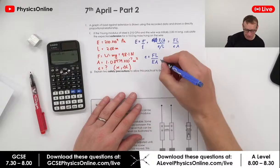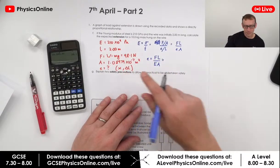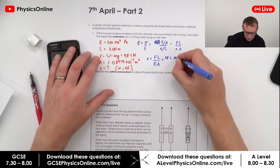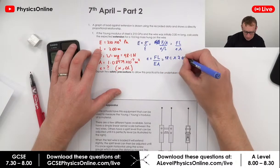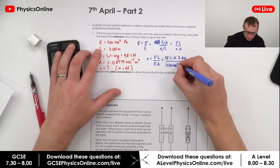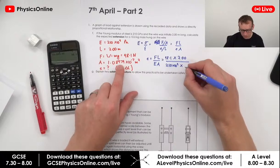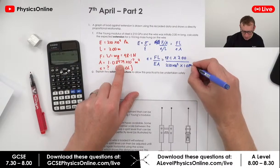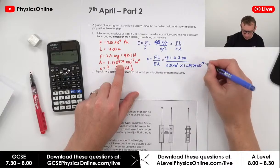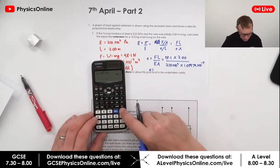Right, so this is how you work out the extension. The thing is, this is easy because we've got all the numbers from here. The force is just 98.1. We times that by the original length of 2.00. The Young modulus is 210 times 10 to the 9, so always big values for the Young modulus. And we multiply that by a really small number for the area, the surface area. And that means that's going to be equal to...